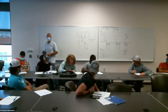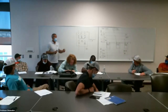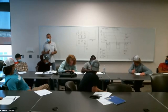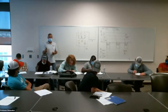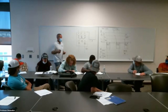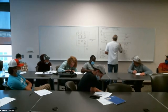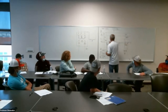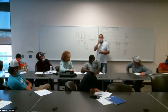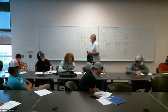Well, I'm gonna throw a curve at you, Professor B. My class, can I use H2 for the input? Yes, as long as you use H1 for neutral. Right, you can swap. I could go to H2, H2, H2, and then move my ground to H1, H1, H1. Not common, but electrically, it'll work as long as you use the same all the time.